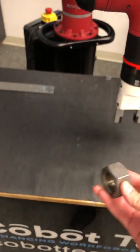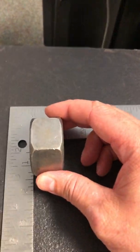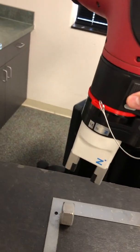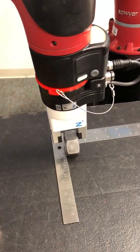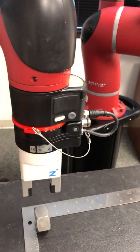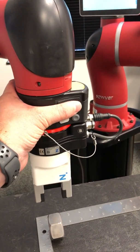Now we have a brand new task with nothing on it. Make sure you have an item that fits in the gripper well — that's important. I'm using this square here to line up my part, because when I move this arm it's going to go back to that pick location every time. It doesn't know what's there — if the part is not in the same place you trained it on, the arm is going to miss because it's just remembering a waypoint.